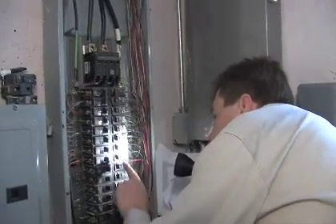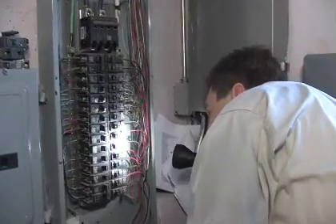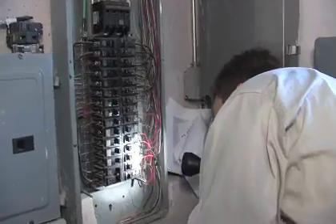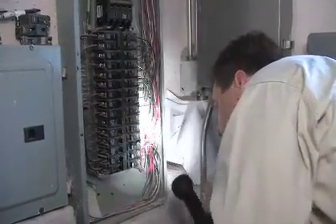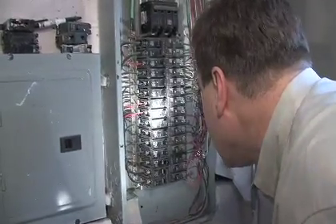There's a correlation between the circuit breaker size and the wire size, and that's the first thing I like to look at. I want to make sure that the gauge of the wire can adequately handle the amperage and the heat that can be generated that the circuit breaker is going to let through.